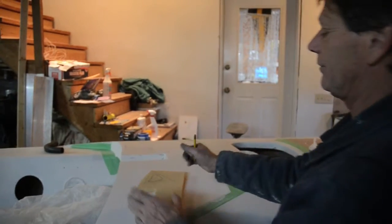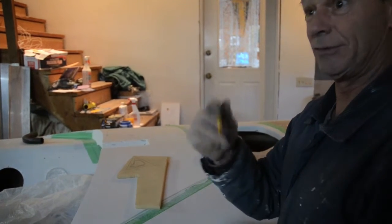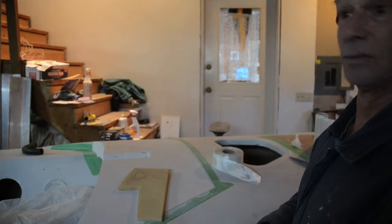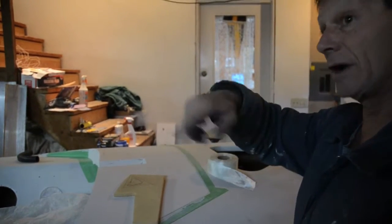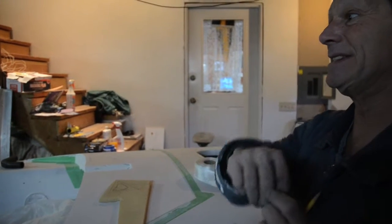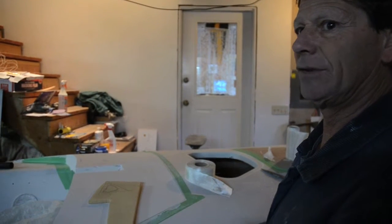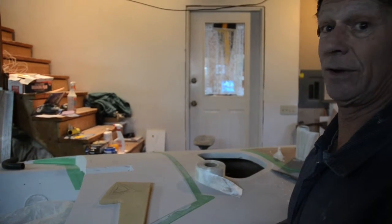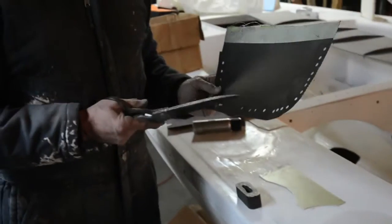Okay. Now for bagging, like on your corners, this would be a little bit different because this is going to be a triangle and it has some other goody stuff that you would use for that. Shrink tape. So you'd wrap some shrink tape on it, heat that, and the laminate that comes out of that is beautiful. So you want to be kind of careful anyway, and you probably wrap this with a bunch of little unidirectionals and lay, instead of trying to make woven fabric do something, do some individual pieces and fit them in place. Really simple. I mean, I make it sound too simple, and I probably don't make any sense, but you sort of know what I mean. Yeah. But all little carbon dots.